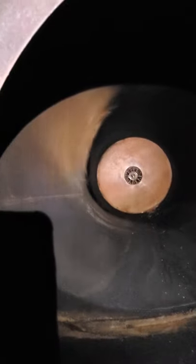As you can see, this one is my chimney. I got my fire tubes, my third pass fire tubes, the combustion chamber. That one is the burner itself. That one is the diffuser. As you can see, I got my fire tubes. Now take a look at it. Fire tubes. First pass is this one. Then the flame goes this way. So second pass, and it comes back to the third pass right here. And it goes through the chimney, right?